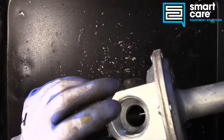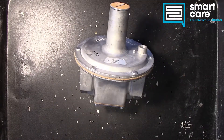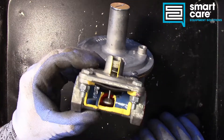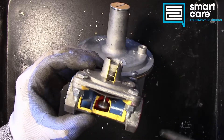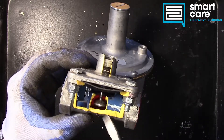It's hard to see right now, but we'll get it apart further and you'll be able to see more in detail. Let's compare it to other regulators first. If we use the screwdriver to go all the way through and then take a look at our RV48 — this is the most standard or most common regulator we see — it's called a poppet regulator. If we try to do that same thing, our screwdriver gets caught down here in the flow path where the poppet is.